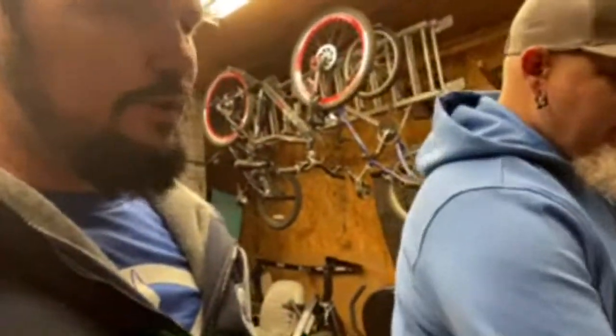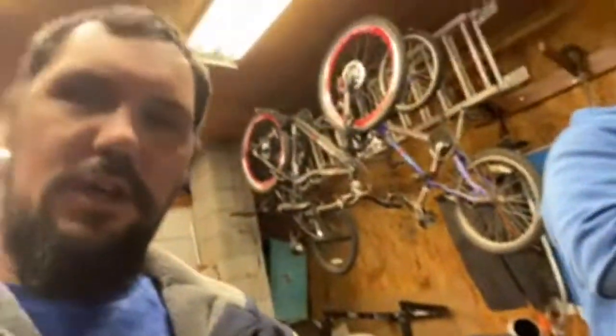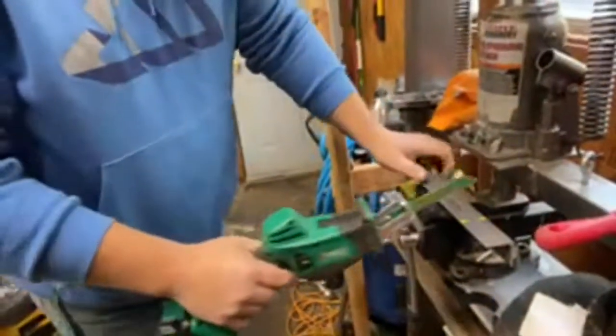Now what we're doing, guys, is we're cutting two and a half. Is that what you're going? 2.5 cuts on three little pieces so we can make cross members to link up the square tubing to the angle for our initial transition plate, is what I call it, so we can put the actual flat stock on it.